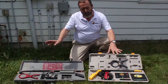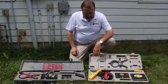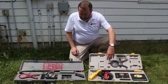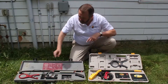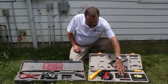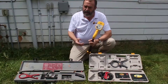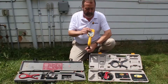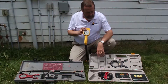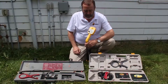Really quick, fast, short cable run locators to find cables between facilities and other shorter runs, so they tend to serve the same purpose. The Pro 871 not only has the clamp like the older one did and the broadcast antenna built in, but it has two trace frequencies — actually three if you include the one with the induction antenna — and it'll find AC power. So between locating at high frequency, low frequency, finding AC power, or broadcasting into the ground using a non-connection mode, this thing is actually less money than the older one and is something on the order of 30 years more modern.